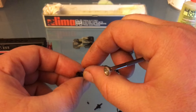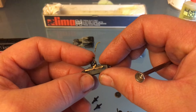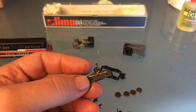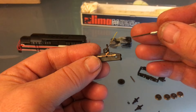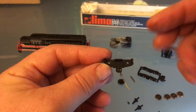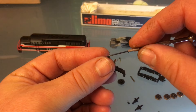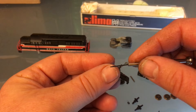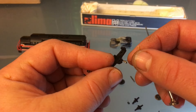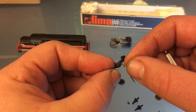So the gears, I'll wash them with my toothbrush and some dish soap. And then this contact strip, I should be able to remove that without causing too much trouble to the rest. It's sort of melted in there, so I'm not going to remove it. I'll just clean them with my fingers, but I will run the whole gearbox under my tap. There's another o-ring made of hair. And this wire is not hanging on by much — it wasn't soldered in, as a matter of fact. The guy just spun it around. I guess he didn't have a soldering iron.